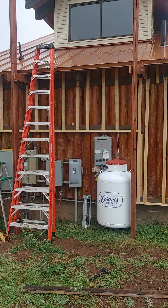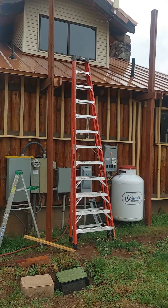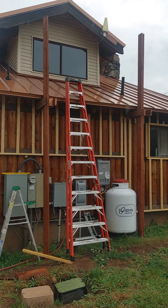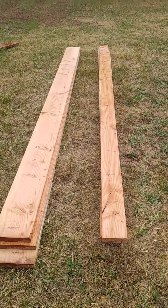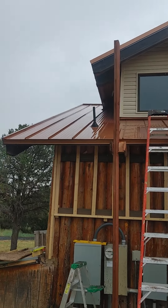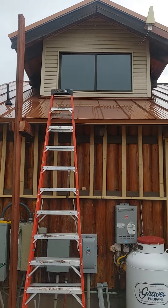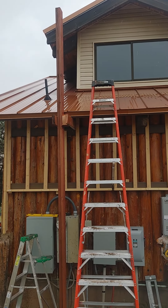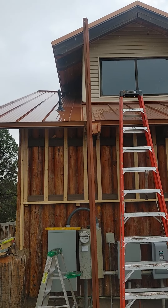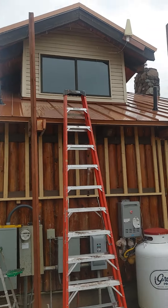So the plan is — see that flash on the window — see if I get hit. Those are two by sixes joined together. The plan is to take two of those two by sixes and run them across, probably about three to four feet up, crossways on both sides, so that I can take those big boards and run one level straight back to that pitched roof to the side of the dormer.